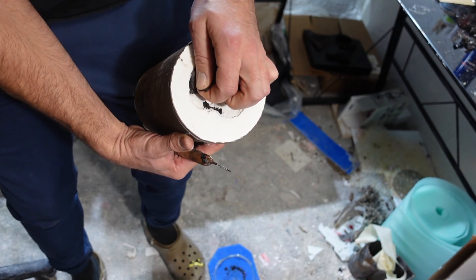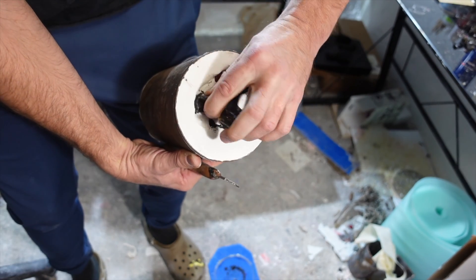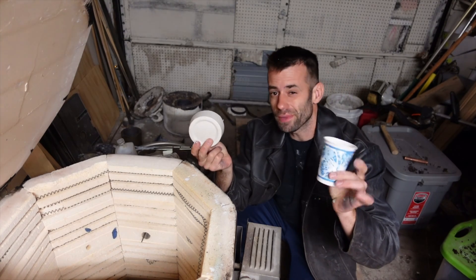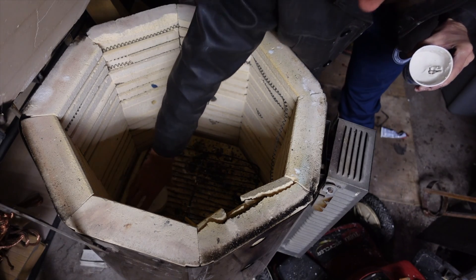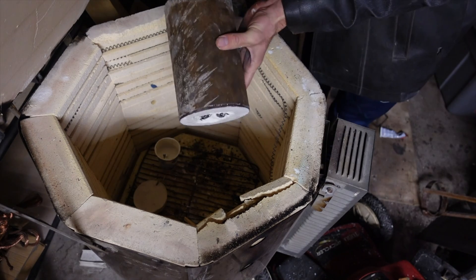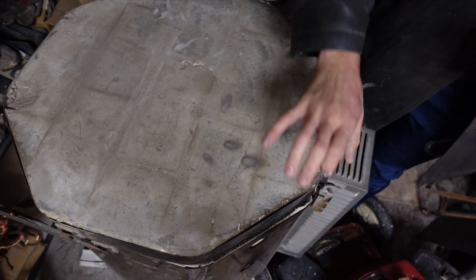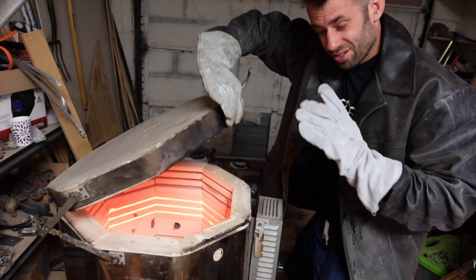This wax plug isn't very pretty but I was able to just pull it out, so I won't have to melt it. These are my test pieces — I'm going to put these in the kiln and come back maybe 12 hours later and check the first one. The kiln will slowly heat up and top out around 1300 degrees, then I'll just let it sit and burn.